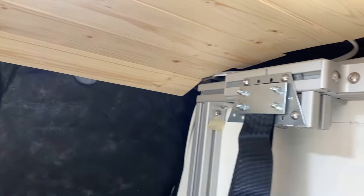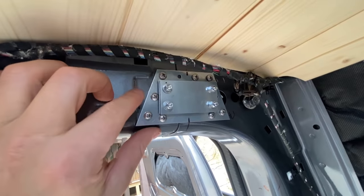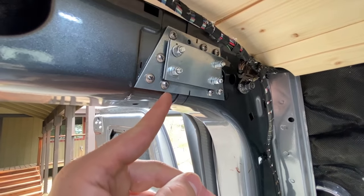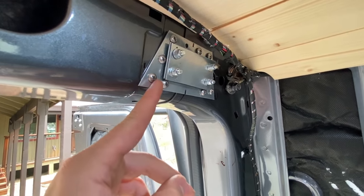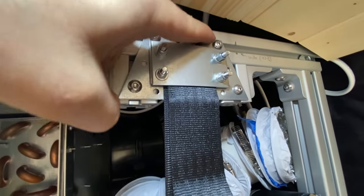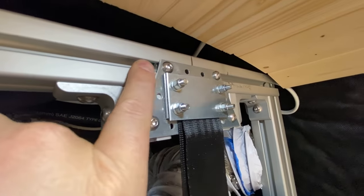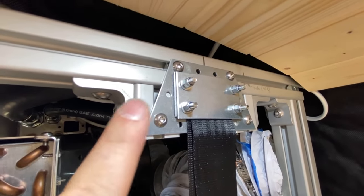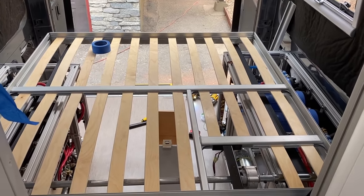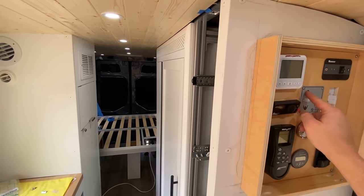I think the smartest move is to just try and make the default system work out of the box. We got each one of the four corners mounted up. The two back ones used number 10 stainless sheet metal screws — each with about 300 pounds of shear strength. The front ones are attached to our 80/20 frame using quarter-20 bolts into T-nuts inside the 80/20 profiles, each with about 1,000 pounds of shear strength. Time for the moment of truth — let's test it.